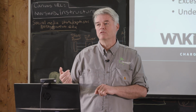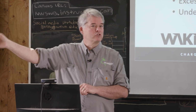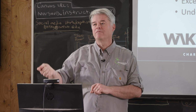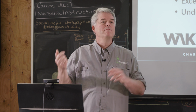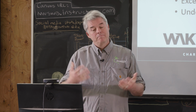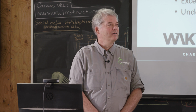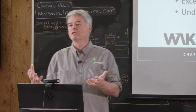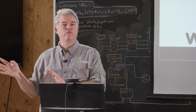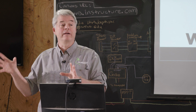We got 7 years out of our batteries before they were destroyed by a shore power charging system. When we were underway and away from the dock, I'd pick up 5 to 10% capacity back in my lead acid batteries because we charged them properly. So lead acid batteries have a lot going for them, but they're 100-year-old technology, and we're at a point now where lithium-style chemistries really have a number of advantages, and they've arrived. It's no longer this mysterious thing on the forefront. So, in my opinion, there really is very little reason to go for lead acid in a high-energy system.